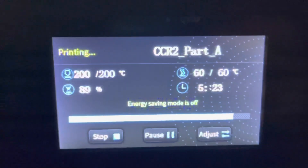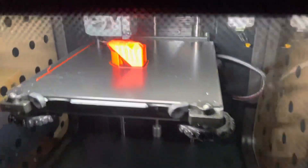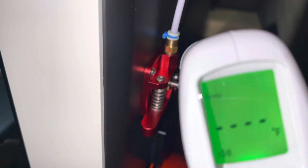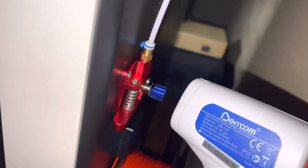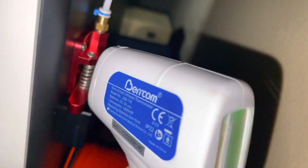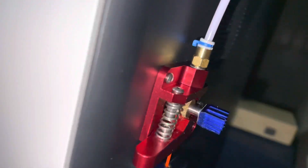So we're five hours into this print, and it has failed. The extruder right here has melted the filament. I added this heat sink, but it didn't work. Once it gets going for so long, it's just eventually so hot that it starts melting the filament slowly. I have a picture later on where you can see exactly how it's melting it in a pulse, and eventually it's just going to get stripped.